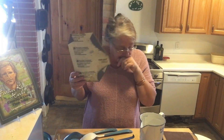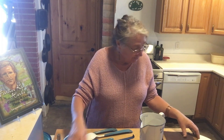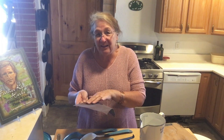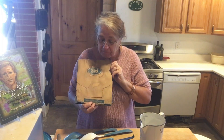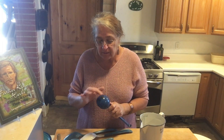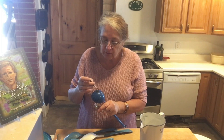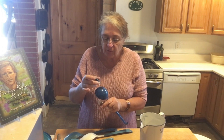Now if you have it, here's an old 1500 grit. There's even something called crocus cloth. This stuff is almost like plain cloth — it's barely there at all. And when I said old, it's really old — it's from Minnesota Mining and Manufacturing Company, 3M. So I guess it's antique but it still works. Just basically smooth out some of the rust and then coat it. It may take two or three coats — let it dry in between. This is just to keep it from rusting any further, and feather it out so it won't be a big globby glom of nail polish.